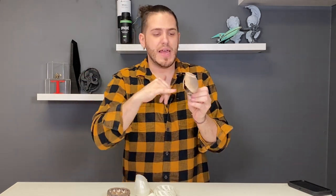Having issues the first time was kind of inevitable. So this was a fail, but we learned something. If you do go large — like busts or sculptures — you need to make sure your wall thickness is considerable and you have enough support. One trick I've seen in foundry casting is putting nails into the master and burning it out with the nails in place. The nails do create a hole in the final piece, but they hold the core, which is really the integral part. We might try this again — follow us on socials to see if we make a bronze version.